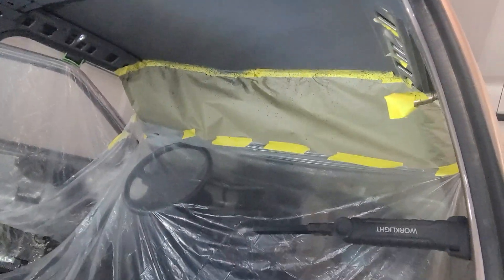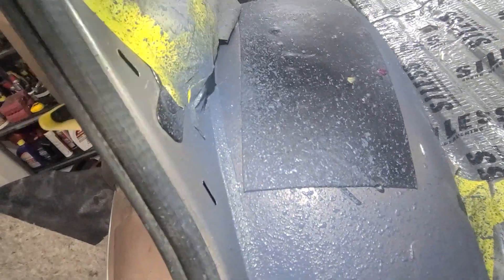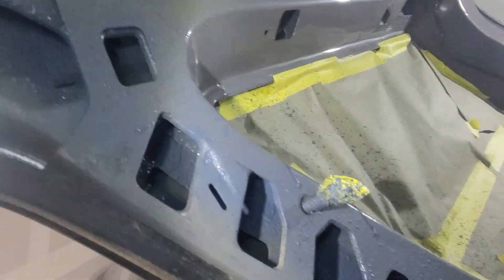Definitely cover everything. This stuff is quite messy. When I was first trying it out, it came out really thick. That was at 40 or 60 psi — I think I started at 60 and did about 60 up here. It looks just really fine. Then I turned it up to 80. They suggest doing a light coat at first — don't overdo it. So this coat here might be a little thick, but I was able to get into some of these holes, which is nice.